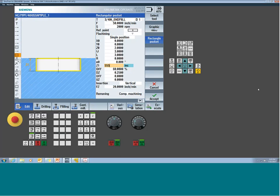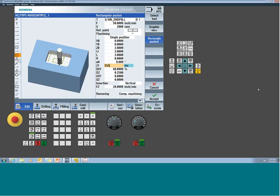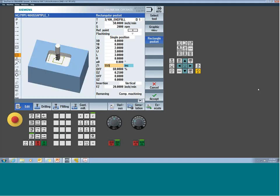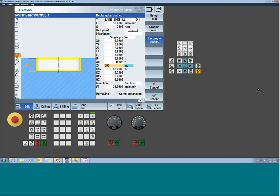Is TRACYL always calculated from A0? Well, no, actually. It's calculated from the Y position I left it at. So remember when I was doing the feature, right? And I wanted to clock it around. So Y0 is going to be at A0. But any Y offset beyond that is going to roll right around the circle. So hopefully that answers Jay's question regarding TRACYL.